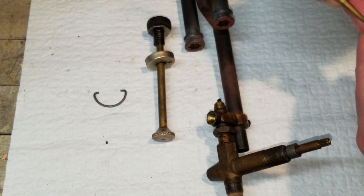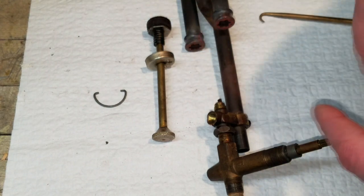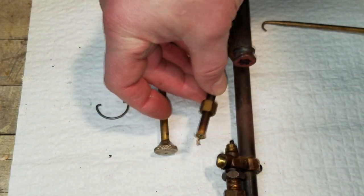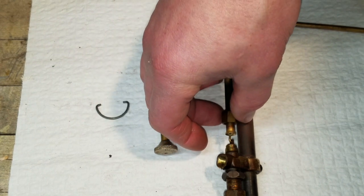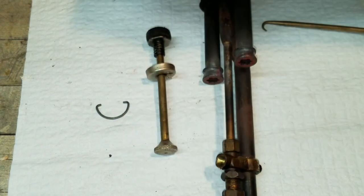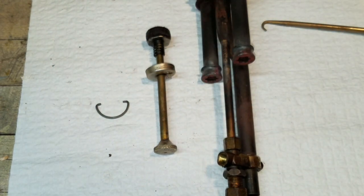Quick, real quick to reassemble. So, if you have that out, you first put the end up into the air tube, you drop it down, you slide it into that little portion of the upper part of the eccentric block. You slide this down, thread it on. Once again, I mentioned for this model, 7/16 open-end wrench, tighten down, sharp rise in torque. Basically, good and tight.